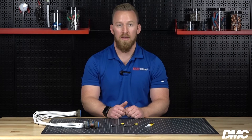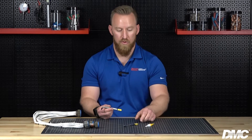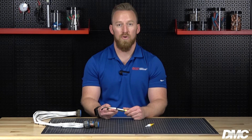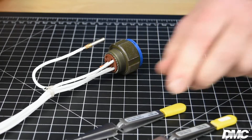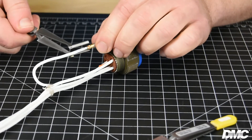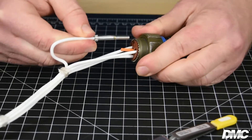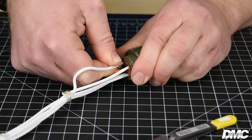I will be demoing the DAK95-12B and the DRK95-12B tweezer style tools, which are intended for use on rear releasing connectors — the side opposite of the mating end. To insert a contact into a connector using a tweezer style tool, squeeze the tool open and lay the crimp barrel or shoulder of the contact at the tip of the tool. With the tool and the contact in line with the connector, insert the tool into the connector grommet until the contact is seated in position.